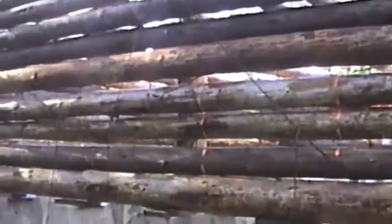Okay, let's get around here. There's Leo. It is a 2-story structure, and this is what you're seeing. What you see here is the first floor. There's 1, 2, 3, 4, 5, 6, 7, 8, 9 logs for the first floor. This tall one here goes up 30 feet from the top of that foundation block it's sitting on, and it's the ridgepole support log. There'd be three of those. We only got the one up. Got 2 more to put up, and the ridgepole sets on it.